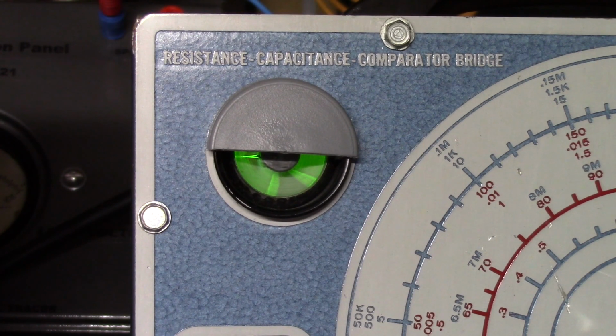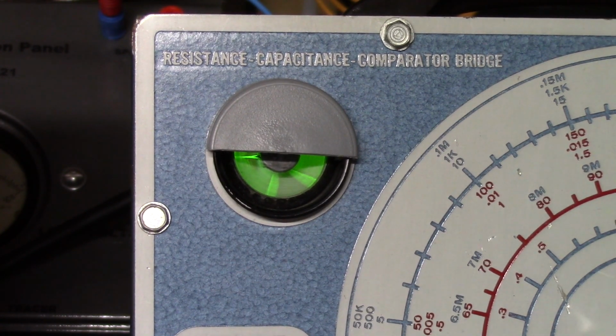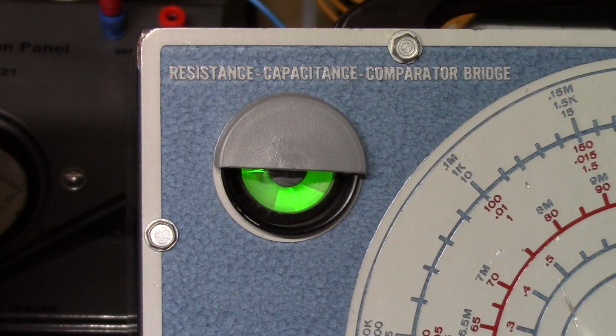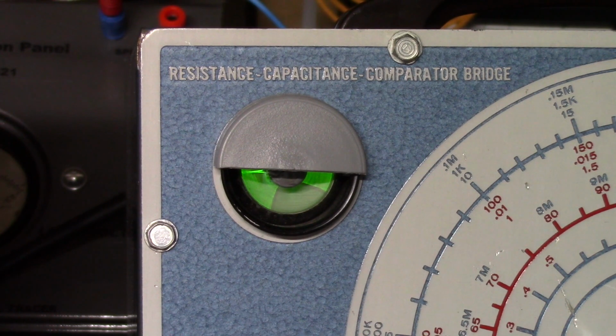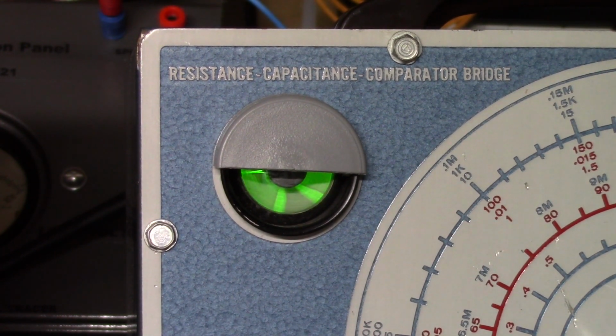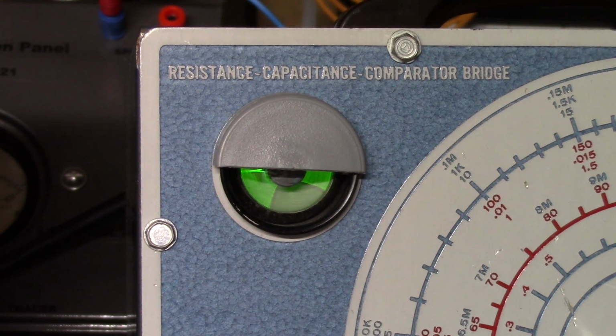What I want to do is try and put some voltage to it. Now, these are supposed to be 150 volt working voltage. So let me get this thing on the test voltage. So here is 10 volts, and it should snap back open. Here is 10 volts right there, and it's not snapping open. It should close when I hit the voltage and open right back up. So whether I go to anything higher than 10 volts, at 10 volts it closes, it does not open back up. So I guess bottom line is I think I'm going to change the electrolytic on it, even though it didn't have much hum, and the unit's working. I'm just going to get that old crappy electrolytic out of there, and we'll change those out.